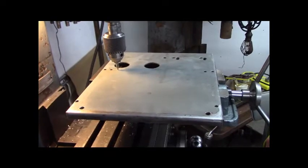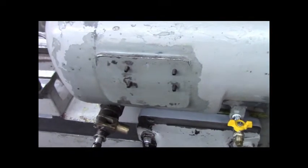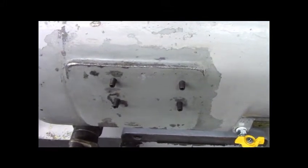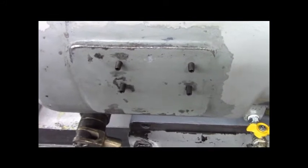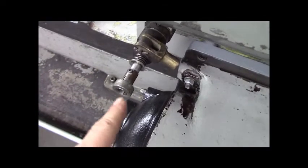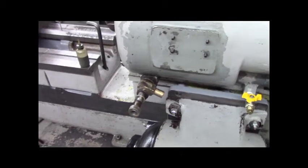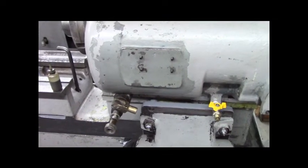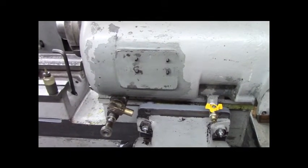That's going to be attached to the back of the lathe with my four little studs in there, and that's going to be a nice rigid mount. Just two bolts holding that whole big piece before, then an electrical box, an auxiliary contact switch, and the main drum switch — a lot of things going on there. I feel better about having extra bolts — studs — just as a little added insurance when things get vibrating.